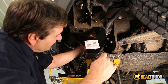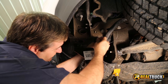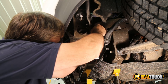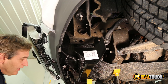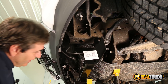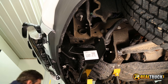So what we're going to do now is take our wire that we used to fish our bolts through and pull it through the slots on the sides of our hitch. Then just go ahead and push the bolt back inside a little bit, because we'll have this wire on here to pull it back in place. The reason why we're doing that is this fits pretty snug up against the frame rail, and with the bolt sticking out, we won't be able to get this up in place, so we need to push that bolt back through a little.